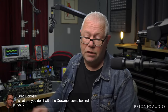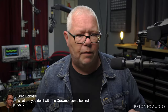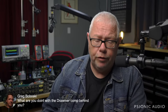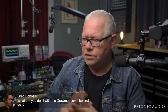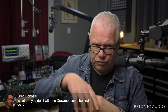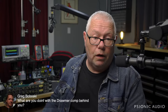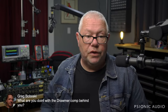And it came in without the fuse for the tube heaters. So the owner's complaint that it did not power on and could not get sound were very true. So it has got two new fuse holders and three new fuses, and it powered right up. And then it was time to do this. So I just got the snapshot at the beginning of the process that I used for the thumbnail for this. And this afternoon, after this, I'm going to hook up some microphones, XLR stuff, and make sure that all the channels are working. But yeah, it's analog, it's tube, it belongs here just like all the other stuff.